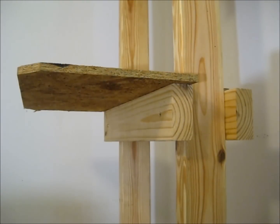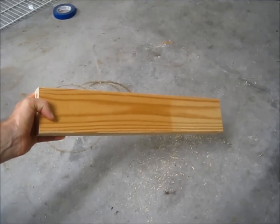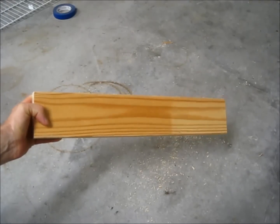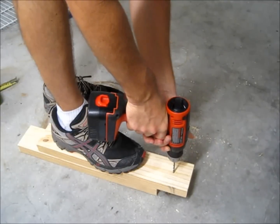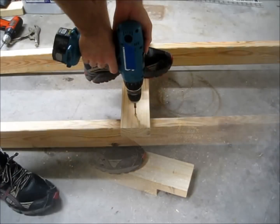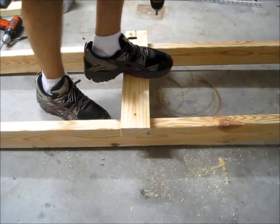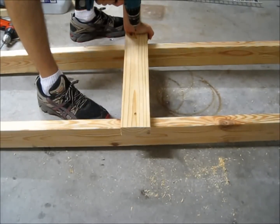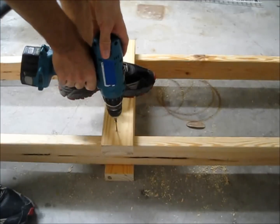The second and fourth shelves will extend out from the ladder. For the second and fourth steps, cut four 2x4s 19 inches long. Pre-drill holes two inches from each end. Screw the boards to the poles at 48 and 84 inches from the bottom of the poles to the top of the rungs. Place rungs on both sides of the ladder.